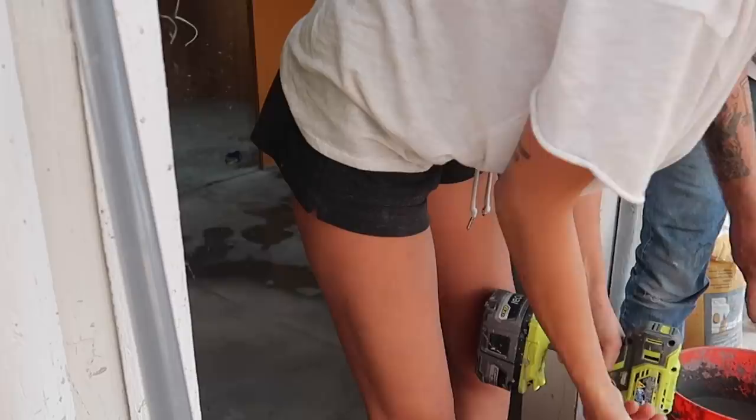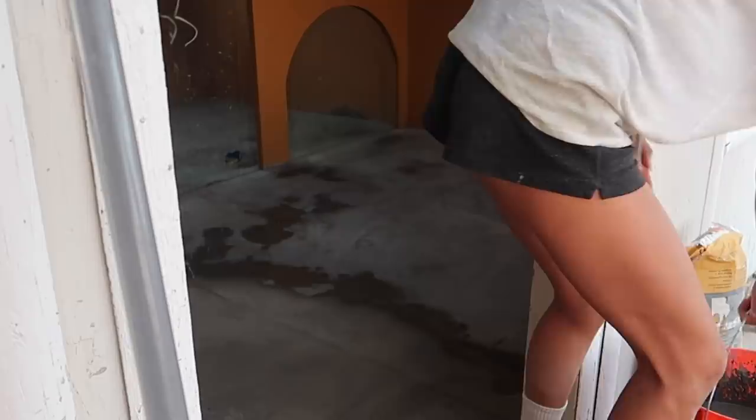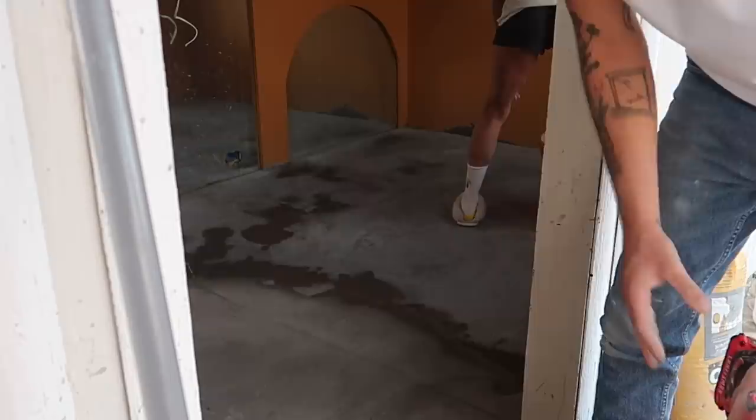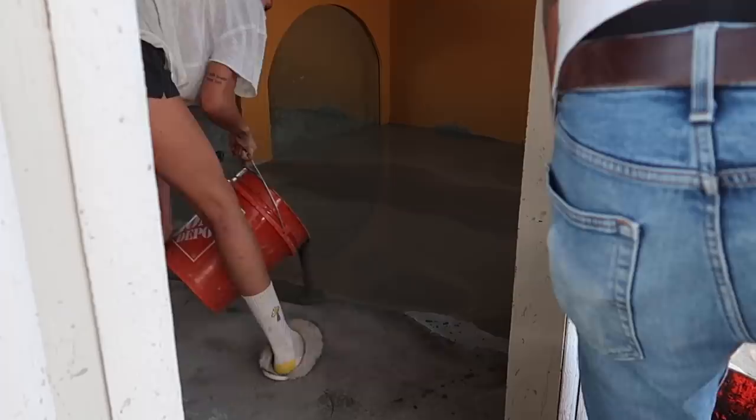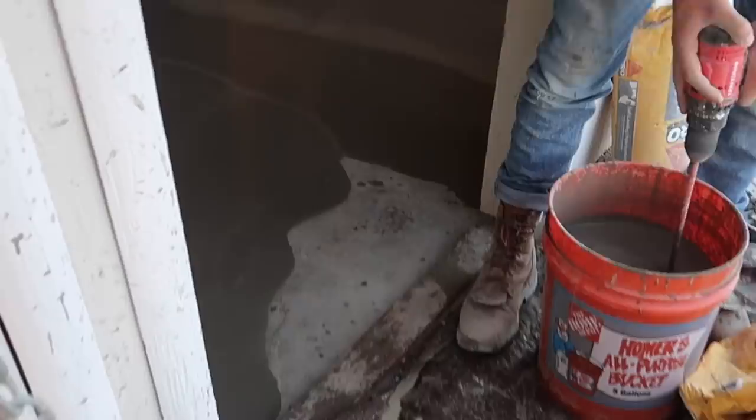Here's the way to successfully pour a self-leveling concrete floor. Now, it can be poured up to 2 inches, so you really can do it. I would highly recommend having two mixers, but it did work with Mike and I for an 8x12 room. By me being the pourer and him mixing two buckets consistently, so no matter when I was done pouring, I always had another bucket to pour directly after. I also did not touch it whatsoever and let it do its magic by itself. All right, well, it went successfully. We literally just took it bucket by bucket and we're just right here now.